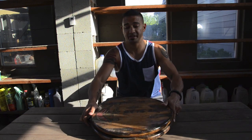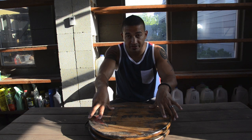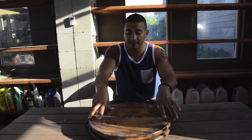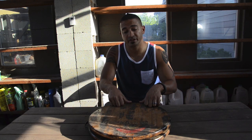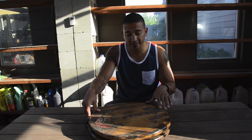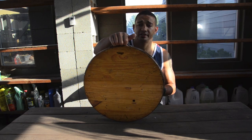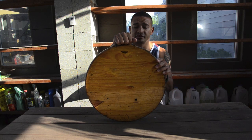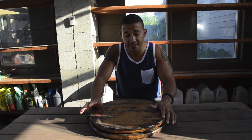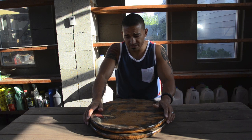For something a little nicer-looking, here's another version I built with a lazy susan and a couple of pine boards from a big box store. I sanded them down, stained them, and applied polyurethane. I put my website logo and my motto on the wood itself, then polyurethaned it. I added a handle so I can easily throw it in my tool bag or strap it to my toolbox when going to a show or teaching a class. The whole thing cost maybe 15 dollars plus whatever time you put in — purely functional but aesthetically a bit better.